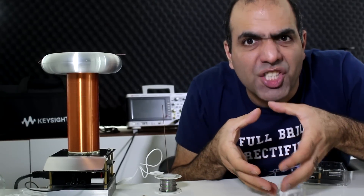Let's get back to the circuit and try to understand how it works. The Tesla coil itself is just a transformer made of a primary with a few turns of winding and a secondary with 1500 turns in the case of this OneTesla kit. The secondary of the Tesla coil is just an inductor connected to a capacitor and they resonate — that's all. There is no magic; it doesn't pick up any strange energies out of nowhere. Tesla never tapped into free energy using his coil. There are millions of engineers every day that use inductors and capacitors in all sorts of shapes and forms and none of them ever pick up free energy out of nowhere. Ever. And that's final.